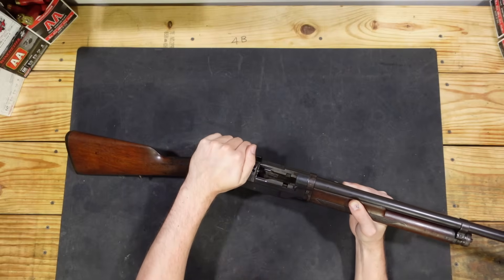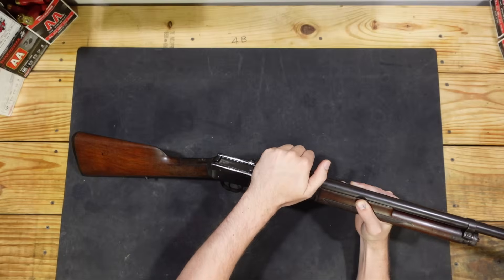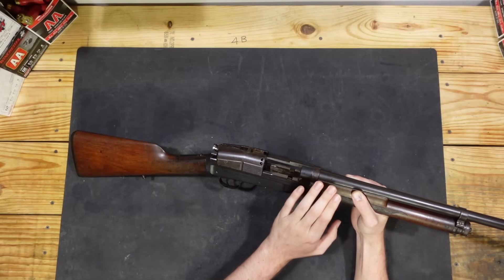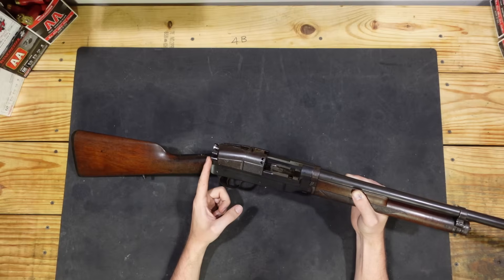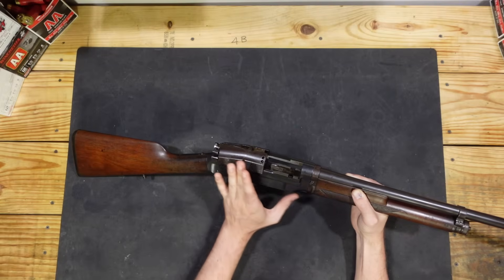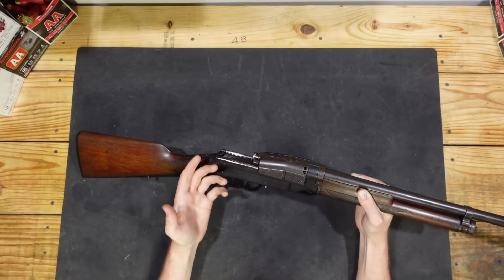And it's at this moment that the gun will cycle. The bolt will be driven to the back by its drive spring, which was compressed by the recoil from the fired round. As it moves backwards, it will compress a secondary spring — which is really the regular recoil or action spring — that will then push the bolt back forwards to chamber the next round.